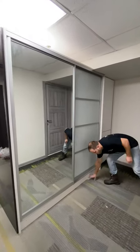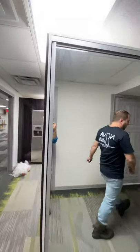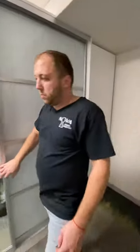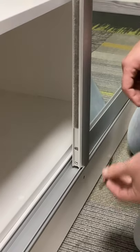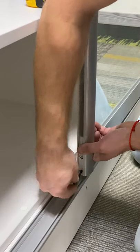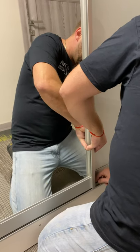Usually what you would do is adjust the doors based on the gaps. That means the closet floor is not straight — same thing on the other side but the other way. So what we do is take the hex key and adjust the wheels. There is a soft rubber piece that also works as a cover for the screws on the door. There's your bottom adjustable wheel — turn it and it literally adjusts your door upward. Now show the gap — I'm doing the same exact thing on the other side. Pick up the door and keep turning the hex key until the door goes up and the gap disappears.